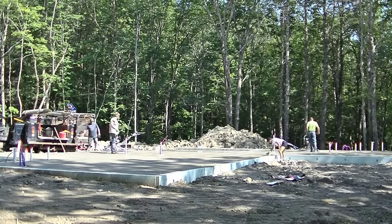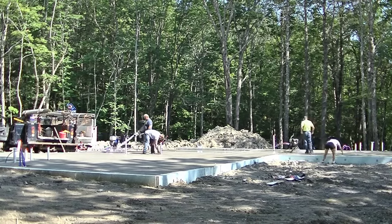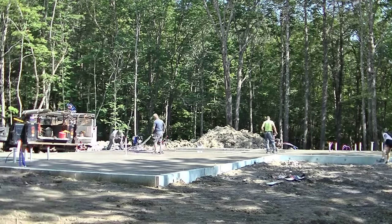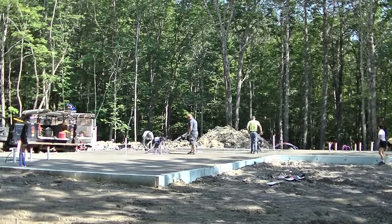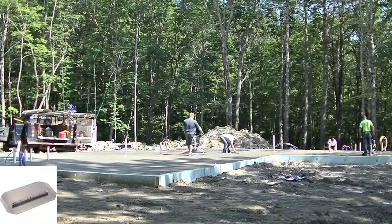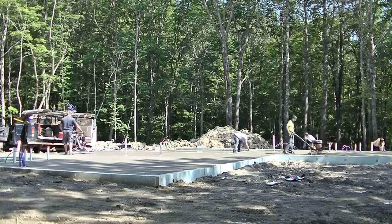And when we float the concrete, there's a few different ways you can do it. We do it with these special blades called float blades that slide on over the finish blades on a power trowel. Now you can have combo blades on a machine, and the big machine right there, you see Luke's in the blue shirt. He's running a 4-foot power trowel that has combo blades on it. So with those type of blades, you can float the concrete and finish them without changing any blades on the machine.